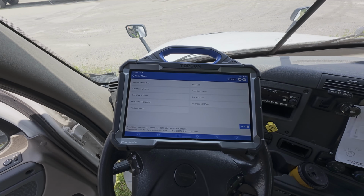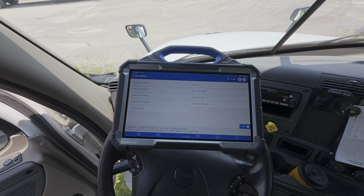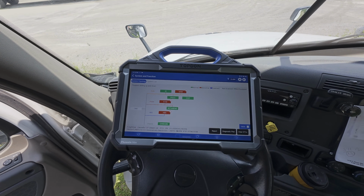It is also dependent on whether or not you are using the generic 6 and 9 pin connectors, or if you are using a specific OEM cable and accessing a proprietary connector. So, what functions you can execute will be affected by how you're connected and where you're connected on that particular piece of equipment or vehicle. So just a couple of simple tech tips to keep in mind as you work on heavy-duty applications.